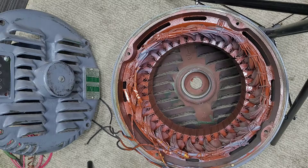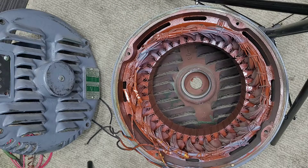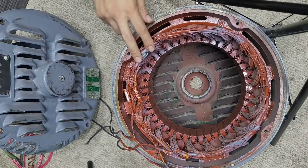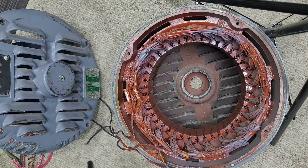Then I'll run those out with the rest of the leads and I will have a six lead motor again. I should be able to run this on the low voltage setting or high voltage — I'll have that option now, and it will be back to its factory configuration the way this motor would have left from ILG. Now that I know about it, it's not anything very complicated. After having rewound a few motors I noticed these connections are all right here, so I should be able to get into the connections, find where they're tied together, and put those new leads on.